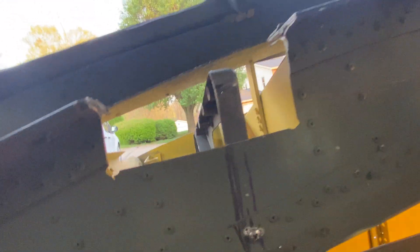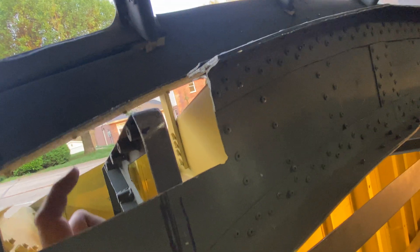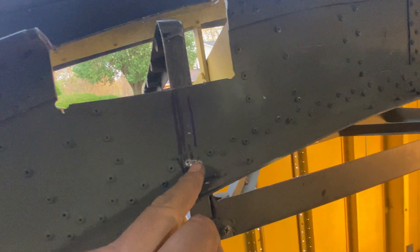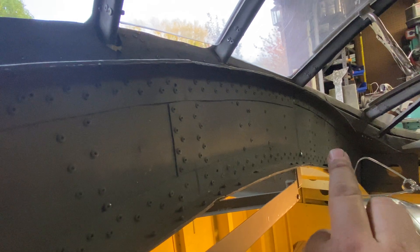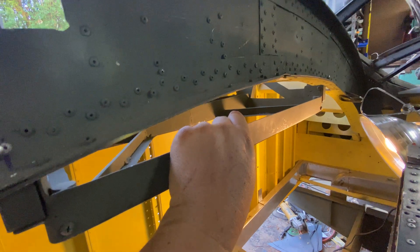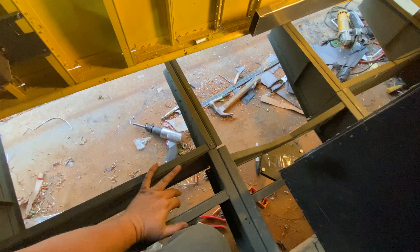This will be tremendously easier to fix — I just have to duplicate this flat part and pop it on there with squash rivets, then build these cross members — or stringers — and get those up there. These things are held in by just two 10/32 bolts right here, and two more over there. With these done, we've got the elevator segment supports done and the rudder segment supports done.